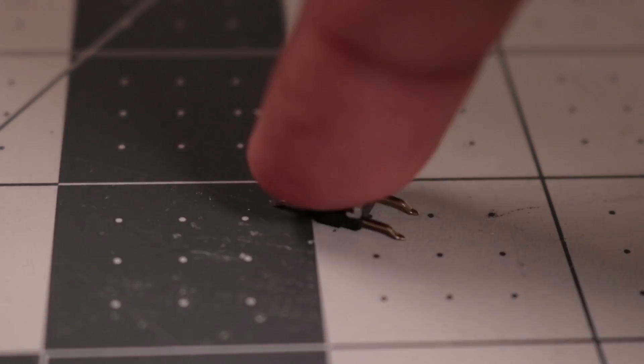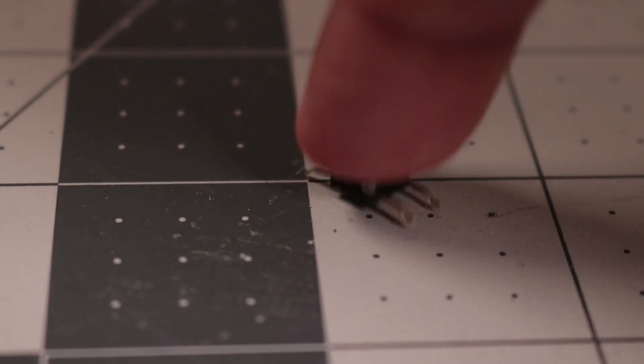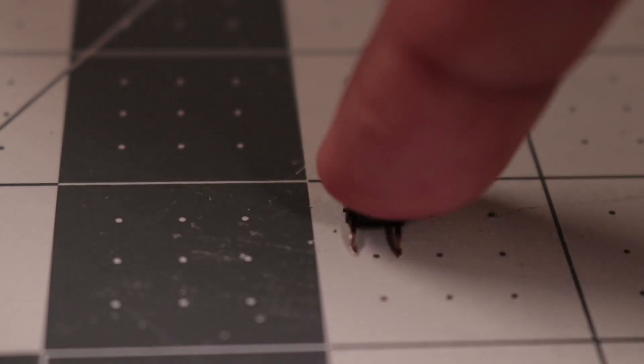Do you miss the simpler times of text entry? Do you miss T9 and repeatedly pressing buttons hoping that predictive text does what you think it'll do? Me neither. But we will have to stick to the older ways of text entry if we want this thing to be sensible to build. So for this, I'm going to be using tactile switches arranged in a 4x4 keypad, which will be more than enough for the interface while also conserving GPIO. Ultimately, I'd like to design a full PCB that has a miniature QWERTY keypad, but I think that's something I'll save for a future build.